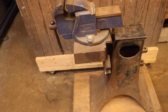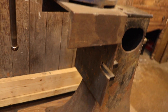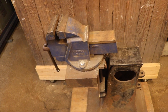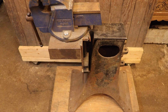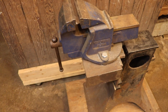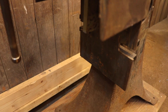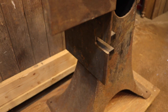Here's an example of how I'm using this stand today. I have a filing vise set up in that bracket and do some light chiseling, so it doesn't matter that it's overhanging the edge this far. I have the base on a rolling platform and the height of the vise is perfect for when I'm sitting, so if I need to do something for a long period of time this is quite often the vise I'll roll out and use. This is something that often gets overlooked — having a vise this low actually serves very well as a hardy hole substitute.